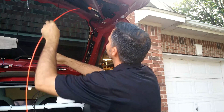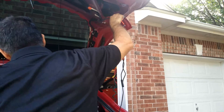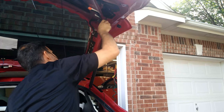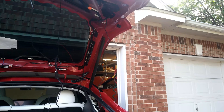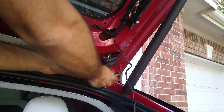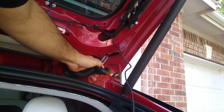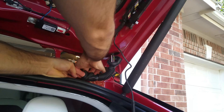I think the order of the day is to start fishing this through with this long hook here. I can see it right here. Let me at least get it this far before we continue on our way. Let's stop there before we continue on. I'm going to be going back in through here. I've dealt with this before. I'm going to wrap these wires with electrical tape as far down as I can get it, because there's a tendency to break some of the wires if one is not careful. So I'm going to undertake that step now.